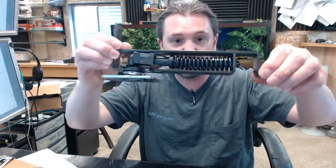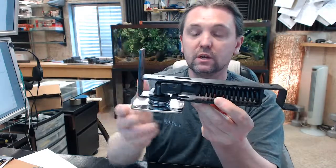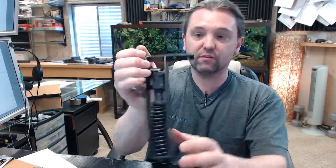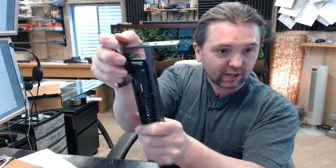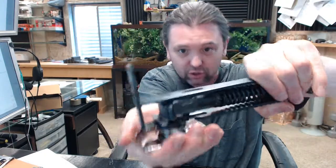So the 7802 will give you a spring tension intended for a door of that size, specifically non-adjustable. There's no adjustment on the spring tension here, whereas other models from Bommer, their 7801, will give you the ability to set the tension. This is for a 35-pound door up to 3 foot wide, and as a standard duty or lighter weight of their three models, I can turn that, whereas with a heavier spring you can't do that, and as a result you can see what the operation looks like.